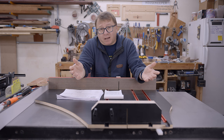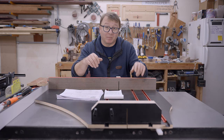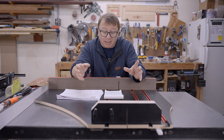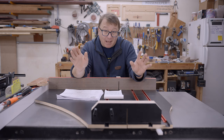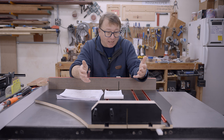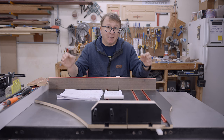I had a little extra 14-millimeter plywood, so I decided to double it up. I spent about two hours gluing the fences together. It took forever to get the boards aligned; I had to wait overnight. When I took everything out of the clamps, nothing was straight, nothing was parallel, and very few things were actually flat. A key feature of a crosscut sled is that the rear fence is completely flat. By doubling up the wood I got the thickness I needed, but not the flatness I needed. I tried jointing the plywood to flatten it, which is not a great experience.